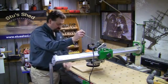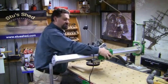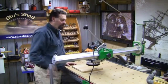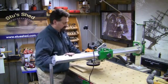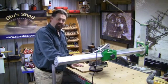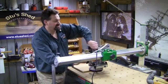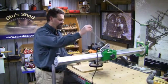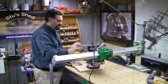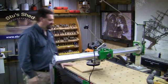That's about right — I lock the carriage, and now it's restrained in the X direction and restrained in the Y direction, so all that's left is to actually plunge into the work. Last thing to do is set the depth stop — that's my full depth, so if I cut to that depth I've plunged all the way through the work. That's now set, the job is all set up, and that's how easy it is to set up for a circle cut.